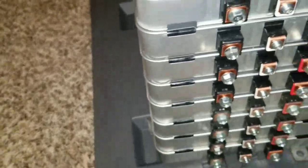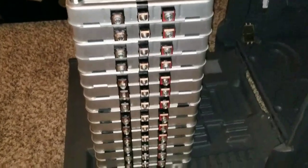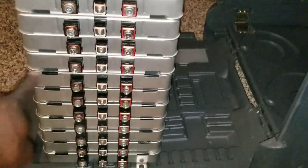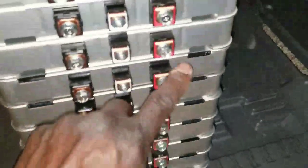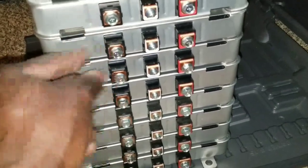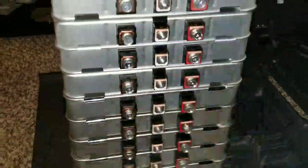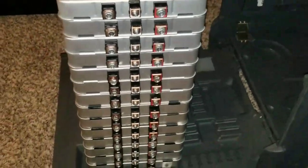I'm gonna be using this method to link the batteries together for maybe five to seven days, then I can take them back out, take the seven and flip them over — the positive is gonna end up on this side. I'm trying to set up for the 12-volt configuration at that time. So we'll have a positive here and a negative here — it's just a matter of putting this bus bar right there to series the pack, giving us positive down here and negative up here.